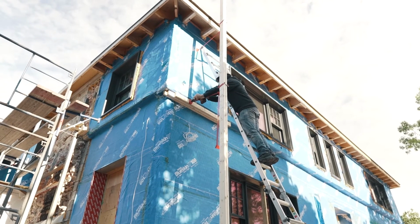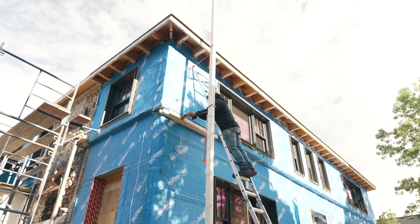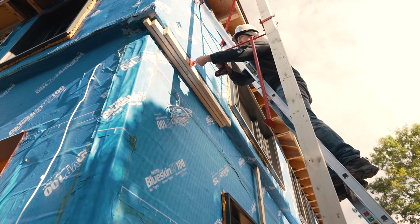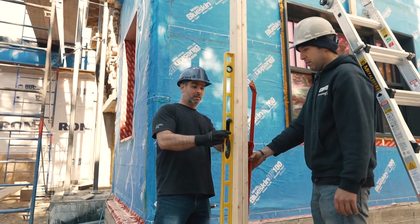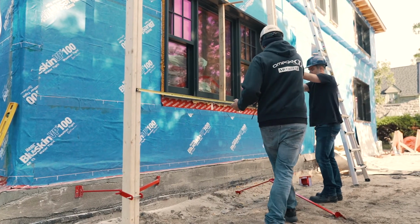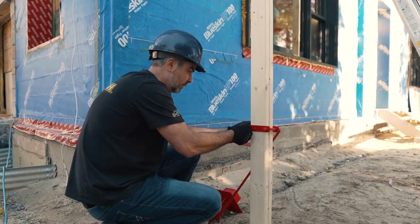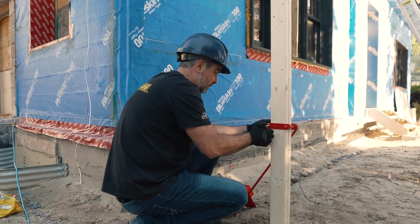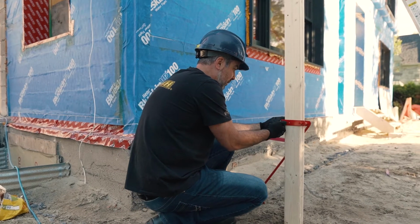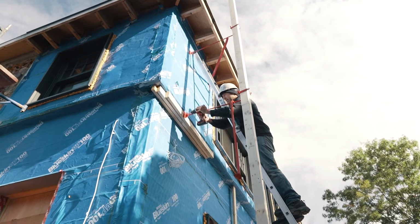Screw the brace on the working wall by using the required hardware according to the type of wall, and make sure that the braces are locked in place. Make sure to install the pump jack poles and braces 7 feet apart, center to center, and that the seams of the pole are facing the wall. Install the steel brace at the bottom of the pole. Additional pump jack braces may be installed vertically along each pole every 10 feet.